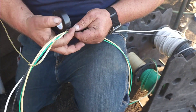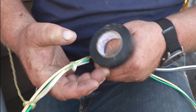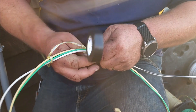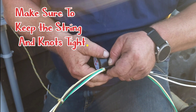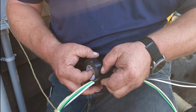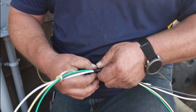Wrap — I'm stretching it as I pull. If you don't stretch the tape, then it'll stretch while you're pulling. And if it stretches while you're pulling, then your wires will come out of the pull. And I'm pulling 161 feet. The last thing I want is these wires to come out while I'm pulling and then have to pull 80 or 90 feet of wire out and have it tangle up, because when you pull it out, it wants to recoil like it's still on the spindle.